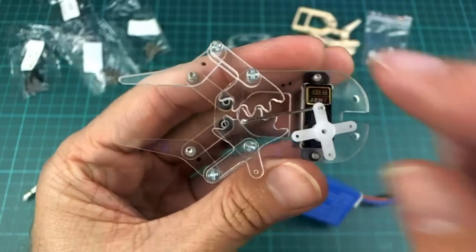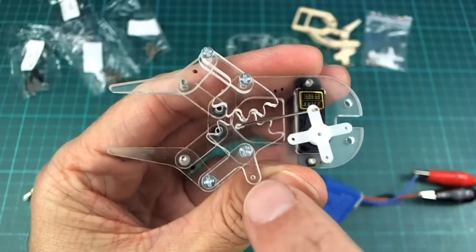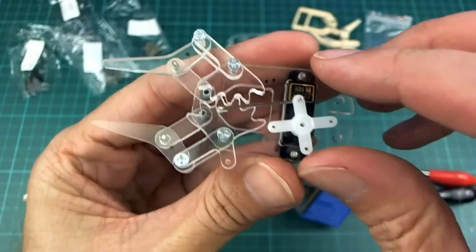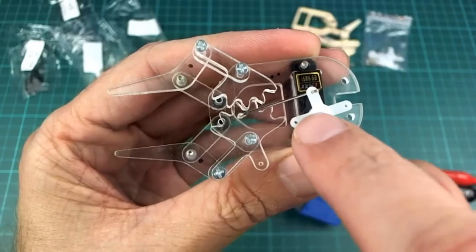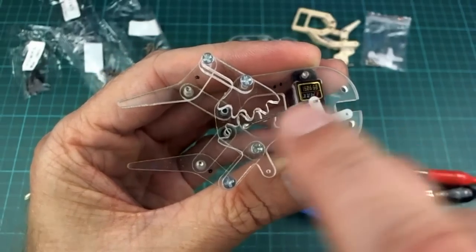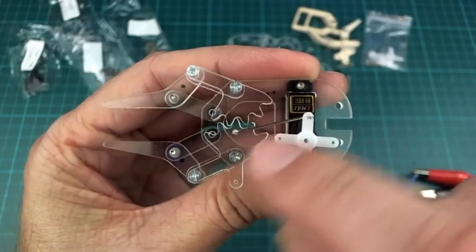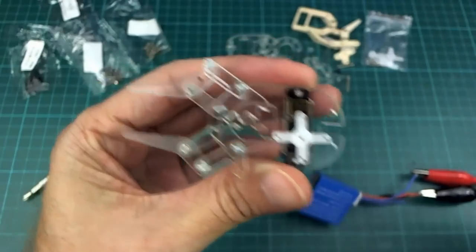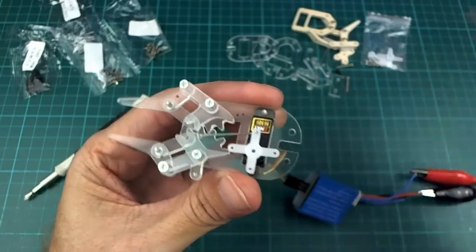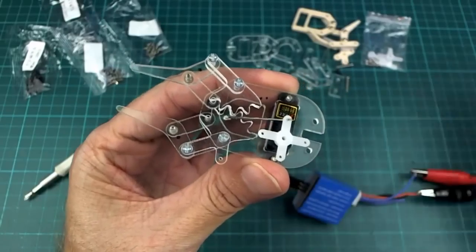And I had originally had two of these tie rods, so you can see I had one here and here, but I don't think it's really necessary. And it actually makes things trickier to manage because you need to get the length of the tie rods exactly the same, otherwise as it turns around, one of them becomes too long and one of them's too short. So you might as well just have one, and it seems to work pretty well. So let me just turn this thing on and I'll show you.